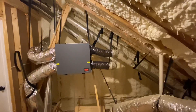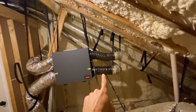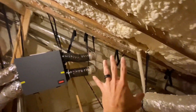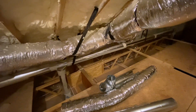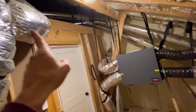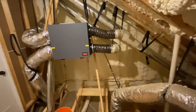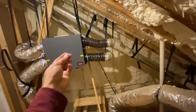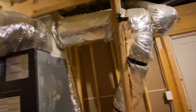So if you're not picky about where you're pulling the air out of, then I think hooking it onto an existing system is okay. Maybe a good idea I could have tried: use the existing ductwork for the supply side where it's pushing fresh air into the house, but for the return side where it's pulling air out of the house, run that as independent ductwork. Then I'm still saving money — probably at least 500 dollars or more — and saving a bunch of labor, but I'm still able to pull from the laundry, the kitchen, and the bathrooms. You can put the return pulling from specific areas, but when it pushes fresh air into the house I could just hook that right up to the existing ductwork.